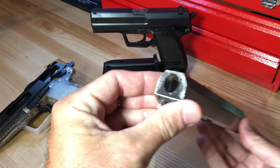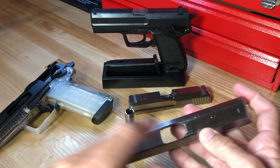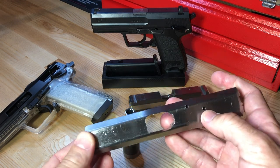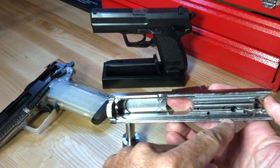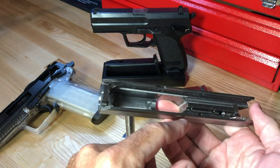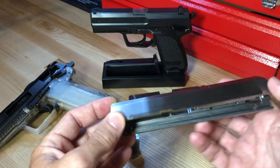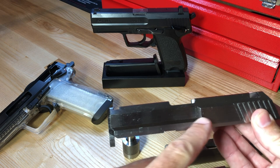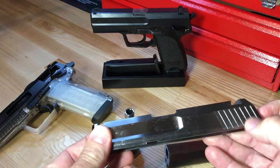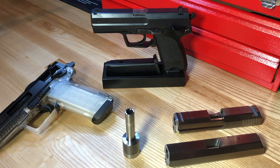In the next phase, they cut the tang for the recoil rod assembly, the front for the barrel, the top of the ejection port, and the two holes for the extractor roll pin and firing pin assembly roll pin. The back section for the hammer is cut, the firing pin tunnel, slide rails, lightning cuts on the inside, and the beginning of the breech face. In the final passes, we get the dovetail for front and rear sights, slide serrations, and everything finished off inside.